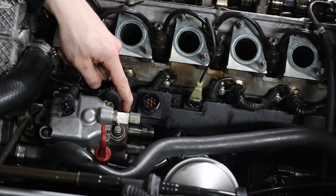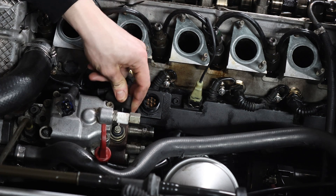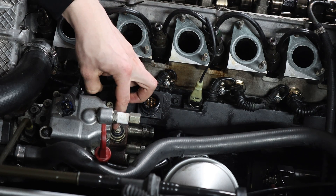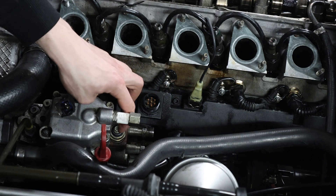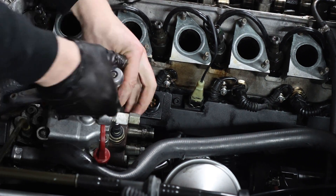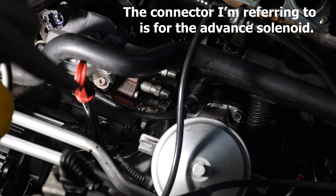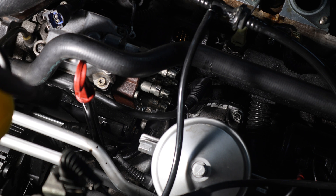Don't forget the fuel cutoff solenoid. There's a rubber grommet on there, and the nut is just the same connection as with the glow plugs — it is an 8mm connector. And now just this connector all the way down there; it is the simple BMW clip-on type.